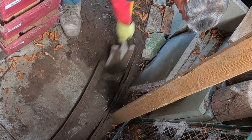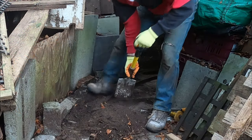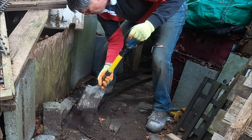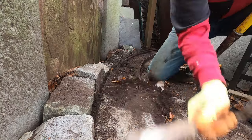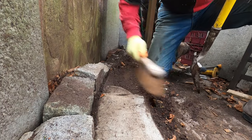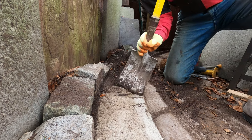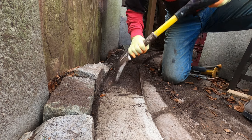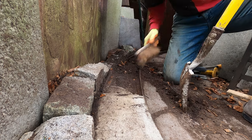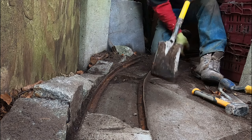The concrete depth needs to be about 40 millimeters at points where there's just soil below, so I need to clear out some of the soil in the trackway. Where there are support blocks or slab stones, the depth will just be about the depth of the steelwork — that's about 25 millimeters. That's okay as the foundation stones and slabs are very firm and well settled in place now.